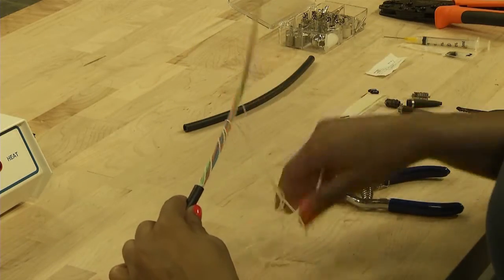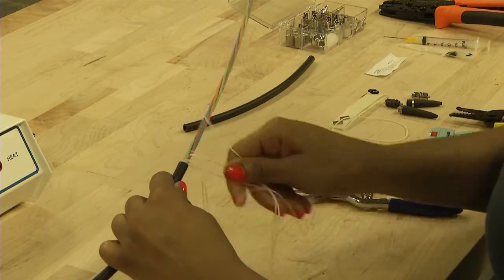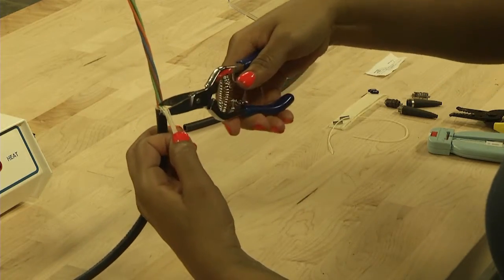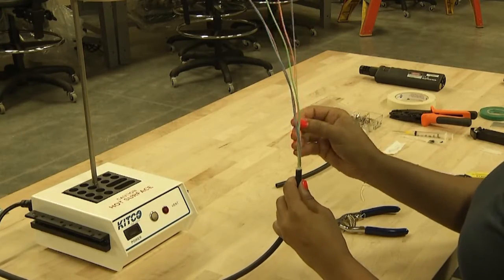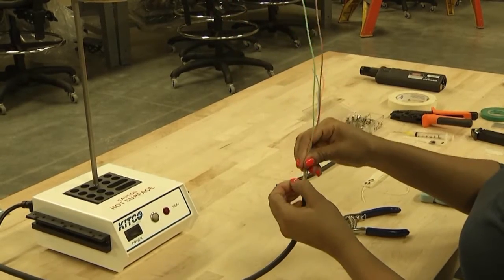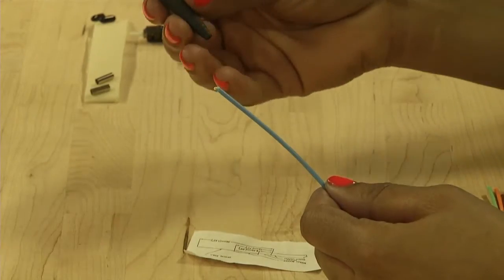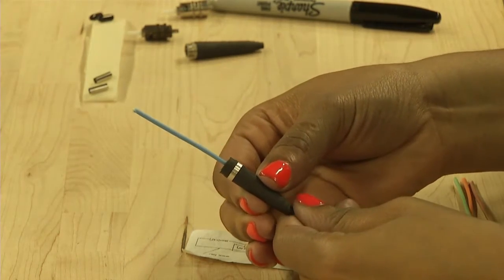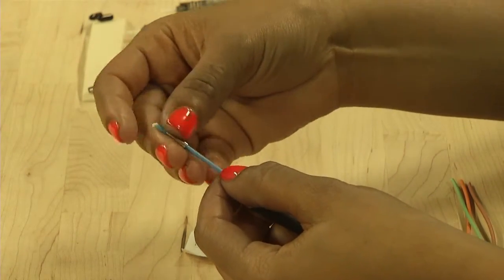Untangle and cut the moisture barrier binders with Kevlar shears. Separate fibers to allow access to the central strength member. Cut the central strength member with the Kevlar shears. For COTS connectors, slide on fiber identification, the boot, and crimp sleeve.